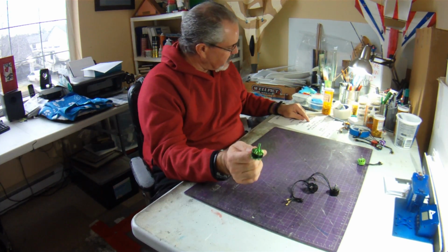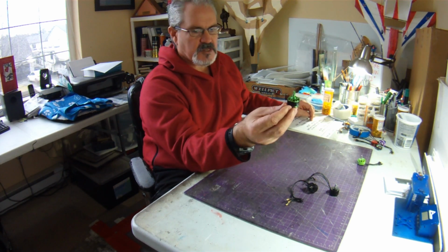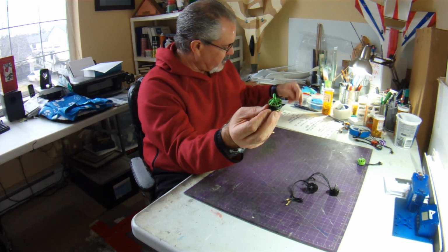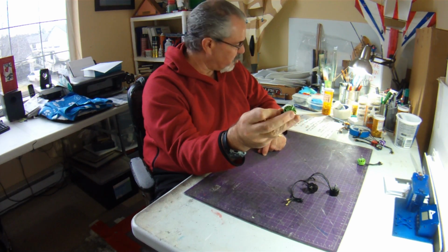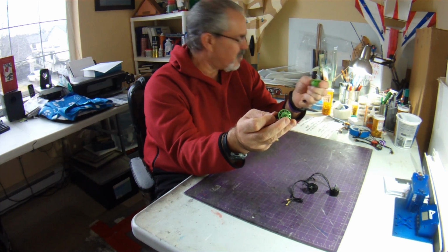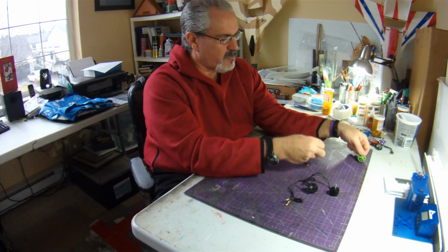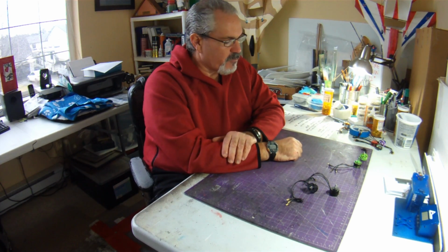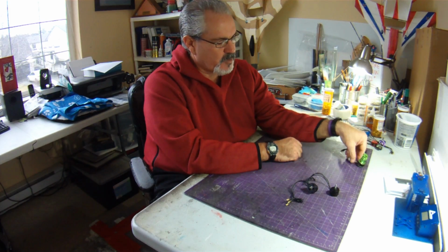I'm sorry, I missed the other numbers on this Multistar Viking. I just remembered. So I already mentioned the price. It's 52 grams, 1.8 ounces, 29.5 amps. So it's the most amp hungry of all these motors. This Racer Star is 48 grams, 1.7 ounces, 26.9 amps. So I think all of these motors with the 6x4 APC gas prop, you could comfortably run with a 30 amp speed controller. I'd keep an eye on this motor because it is a little bit more amp hungry.